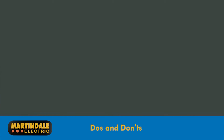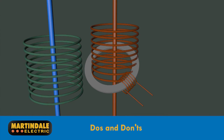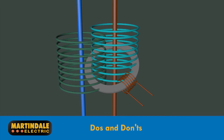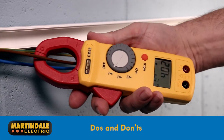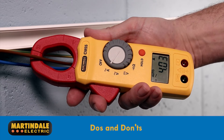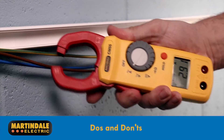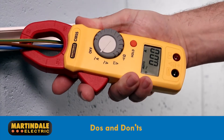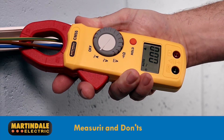With low quality meters, the position of the conductor can cause large errors in readings. In this case, it's always good practice to keep the conductor centrally positioned. Equally, conductors carrying high currents outside the jaw but next to it can cause large errors in readings if the magnetics design and assembly is poor. When measuring current flow within a conductor, it's important to only clamp around a single conductor, which for multi-core cables may mean splitting out the conductor from the rest of the cable.